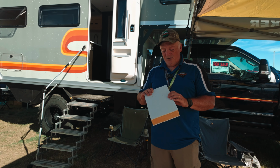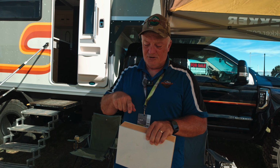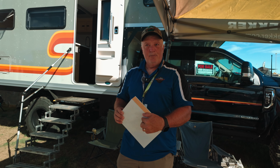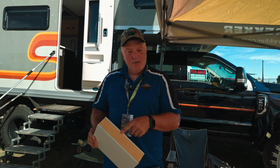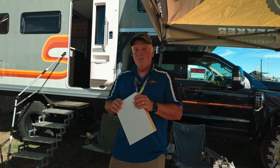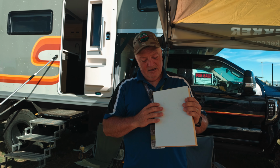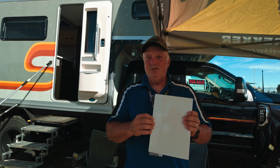And then we also know that you shouldn't laminate a hard or brittle surface to a soft surface. So we have what's called Azdel, which is a recycled polypropylene, as a backer for the FRP. And that is attached to the foam, and then another layer of Azdel on the inside attached to gel coat FRP. And this really helps hold everything together.